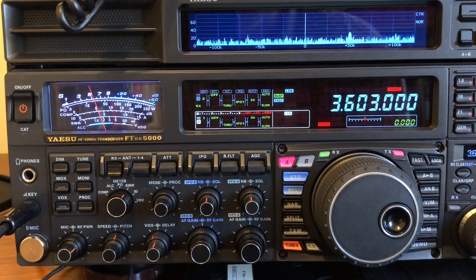And I could see those differences without the preamp, and the signals are quieter. There's no silver bullet — as I said in the last video. The antenna in its original form without the preamp is a fairly straightforward thing to set up, if you've got that ferrite toroid for the transformer, a little bit of wire on the ground, and a bit of coax. It's an easy thing to try, and you can try different directions as well — feeding which corner or which side. The preamp and the extra work I've done today is a bit more effort, and it may be worth trying.